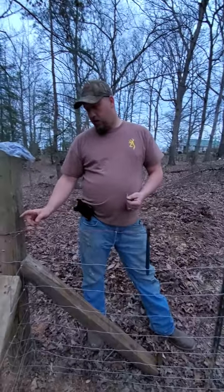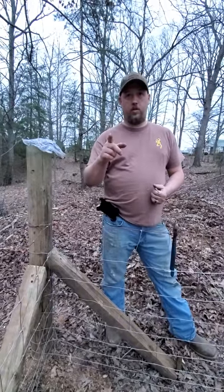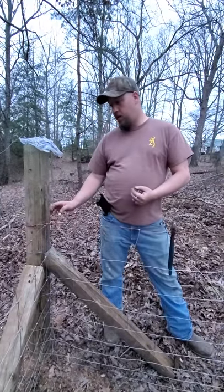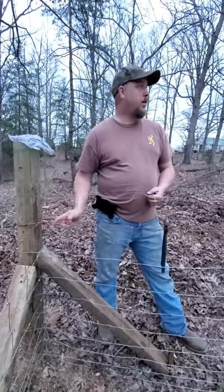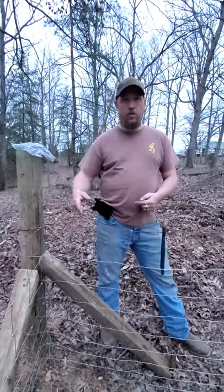The other thing was how we started and stopped in the corner. In the first video I showed you the corner down there where I tied off and then rolled it up here and stapled. After I stapled, I cut the wire, retied off on the inside again, and ran it back up. That way your wire is still in the corner — everything's still inside the fence. You don't loop around the post.